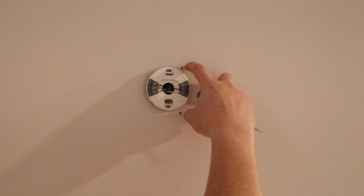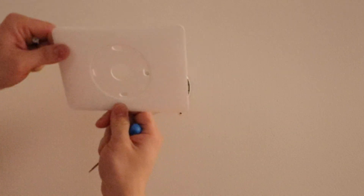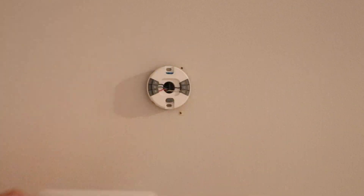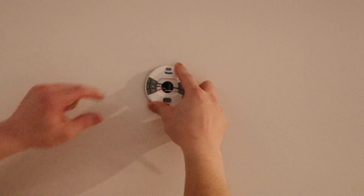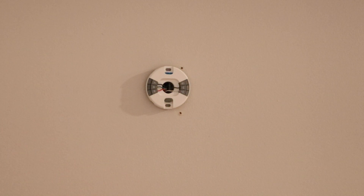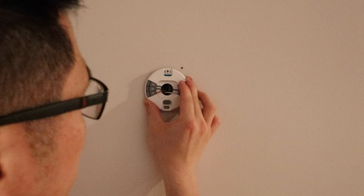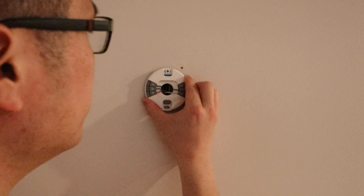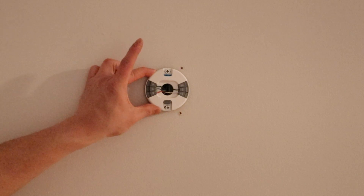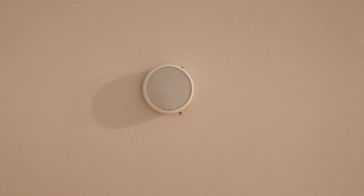If you guys notice, I have the old mounting screws for the thermostat and it's not really covering it up. So this is where that mounting plate comes in handy — you place this behind here so that it would cover that up. I'm actually just going to patch this up in the future, so I'm going to leave the mounting plate out and screw in my screws like this. The Nest makes it really easy because it has this bubble level, so we're just going to make sure that this is level. Once that is secure to the wall, we're just going to take our Nest, push it into place, it's going to turn on, and we'll go ahead and download the smartphone app.